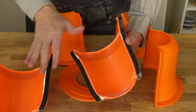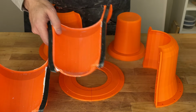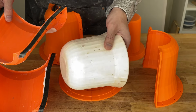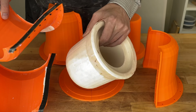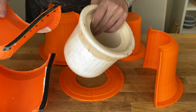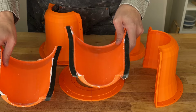And this has worked well. I've had zero plaster disasters, which is great. And I like using the outer molds because the mold itself winds up just being really nice to handle. There isn't a bunch of excess plaster and it basically conforms to the shape of the pot. It creates a basically 1-inch thick piece of plaster, 25 millimeters. So it's nice and consistent and overall just pleasant to use. However, the threaded inserts and the neoprene gasket do take some work.